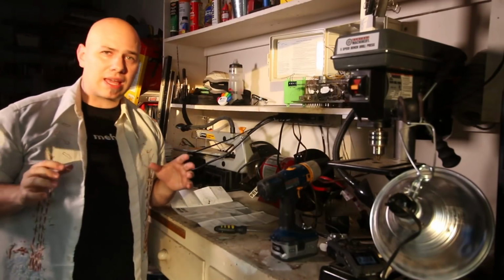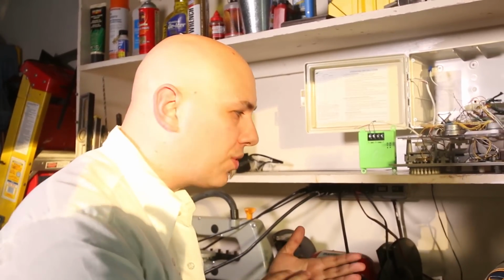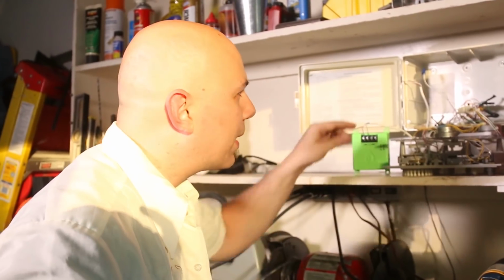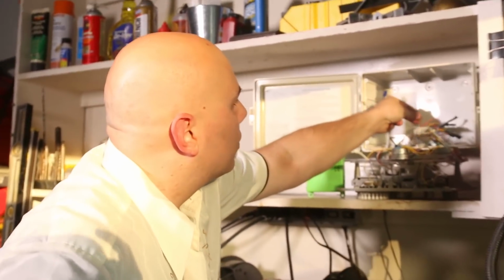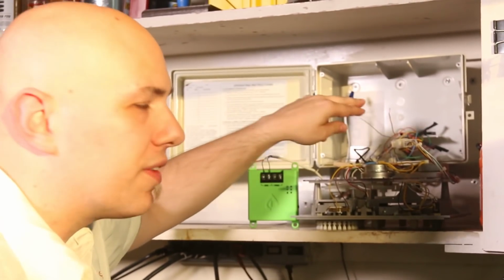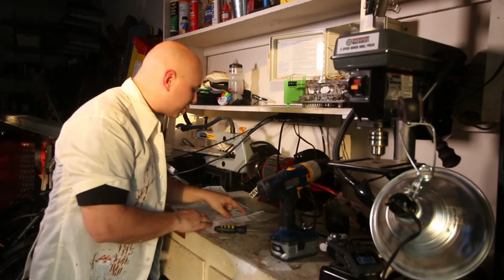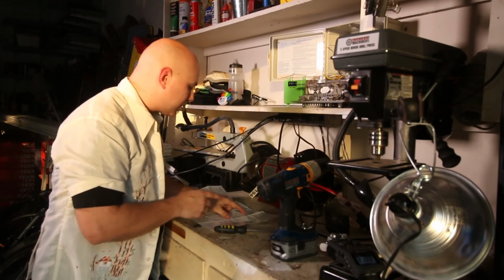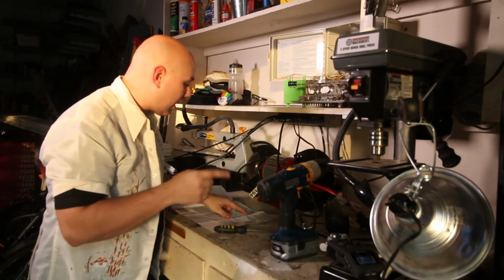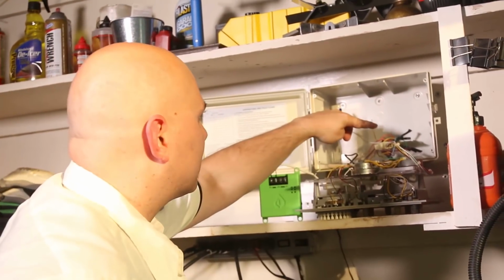I'm going to have to make an educated guess here. My system is so old, I don't have a very good diagram of what wire goes to what, but I think this once white wire, now kind of brownish wire, is the other side of the terminal. So when it says attach the green supplied wire to the right sensor terminal and then the other end to the common terminal on the irrigation controller, I'm going to guess it's this.